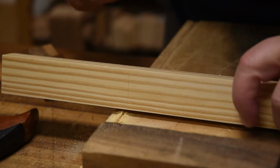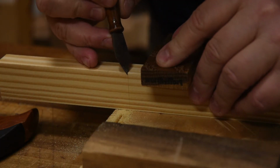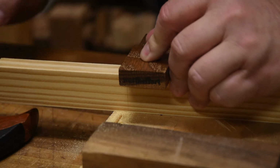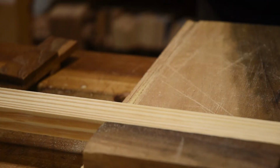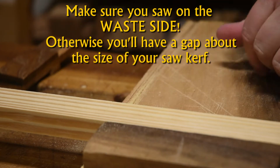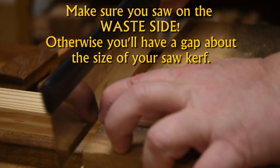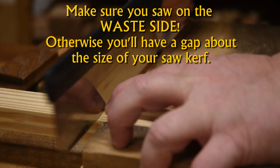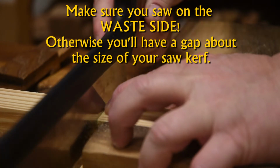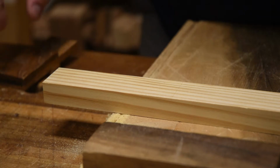Then after marking it, I immediately come over and I will lay out a 90 degree. Just drag until I find that chisel line. Mark it down. And come over and start sawing. Starting on the far corner, lining across the top, then focusing on coming down this side over here, which has that line. And that way, whenever I drive it up, it should be dead on perfect. There we go. And do the other side the same way.